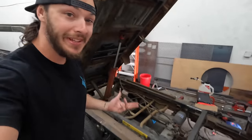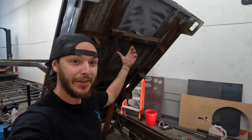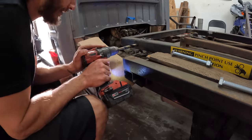Yeah, so anyways, now that we went through with our super long drill bit through everything when it was all down and in place, we can now drill these out separately versus trying to send that 5/8 drill bit all the way through 4+ inches of material. Each one of those dots means we are about as in line as we can be, and we can drill each one of these from either side, which is going to make this a little less painful. But drilling big holes in steel without a mag drill sucks. It's not my favorite thing to do.